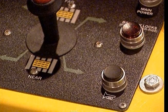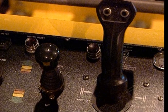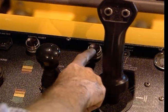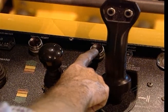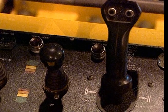Pressing this button activates the battery changer's horn. The master and travel reset buttons are only used on the PCE series power changers. These buttons are used to reset the overload and travel protection circuits. The master reset button lights if the lift inverter is tripped. Pushing the master reset button resets the lift inverter. When this button lights, something is usually wrong with the system. Do not reset the lift inverter until you have asked for assistance from your maintenance personnel.